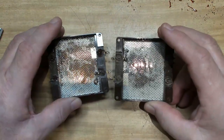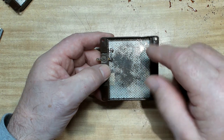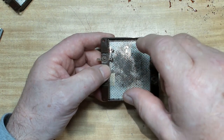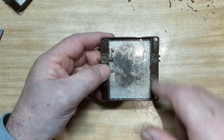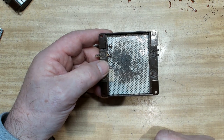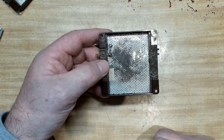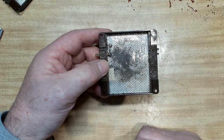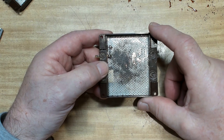Unfortunately this speaker didn't work again, so I've pulled out the second one. Taking what I learned from the first, I unsoldered it from the correct point this time, and just rotated the pad 180 degrees. I put sellotape around the edges. But it still doesn't work - this is completely silent like the other one. Someone in the comments mentioned a repair on the internet - I found it on Radio Museum, someone did exactly the same speaker and got it working. So why these aren't working I don't know. I'll see if I can get a couple of replacement tweeters - failing that I'll just leave them out of the circuit until I can find something to replace them.